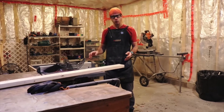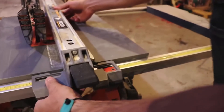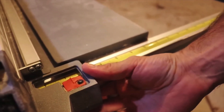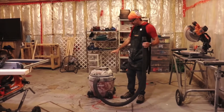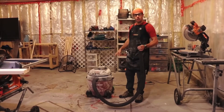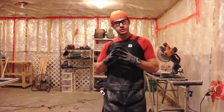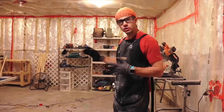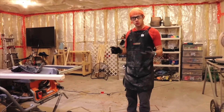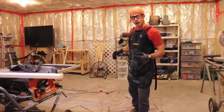Now that the staples have been removed and the sticker taken off, we're ready to rip our wood through on our table saw. We've determined our width is going to be one and one-eighth inches — line it up on the table saw and lock it down. In our shop, our dust collection system is the mobile one, so we move around to each piece of equipment before we start the cut. I have my gloves and safety goggles on. I'm going to turn on the dust system and run the wood through — we're only going to show this once because of the noise.